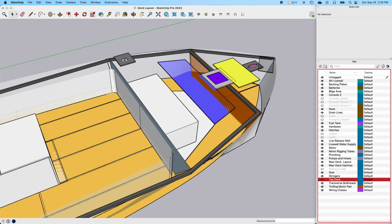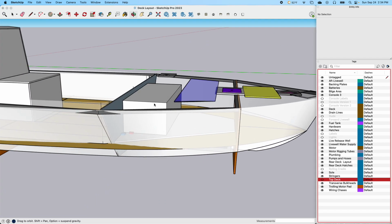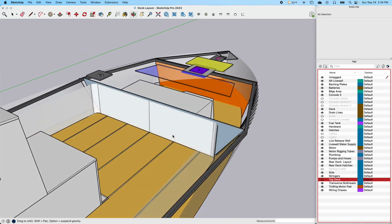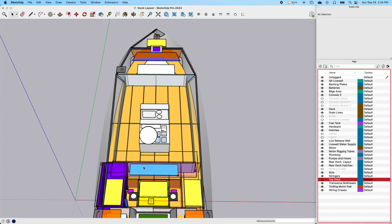So now that I've taken the top off of here, you can see this is my fuel tank where I'm estimating it will be. You can see the sole of the boat, which is basically the floor. You see the partitions, these black tubes here. They are wiring chases, so I'm thinking about putting in a wire chase all the way from one end of the boat to the other along the top there. And I say a wire chase, that would be like a 1-inch or a 1/2 inch conduit or something like that, or maybe have something bedded up in where that deck and the side of the boat join, to be able to put it up in there and have it fixed, as opposed to using screws with wire hangers, zip ties or whatnot.